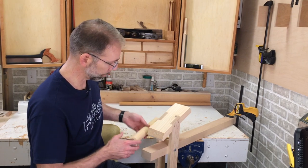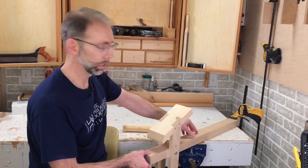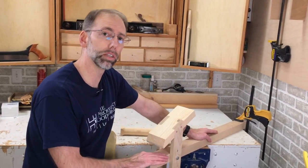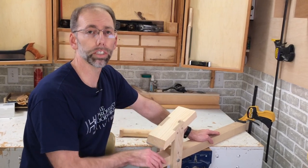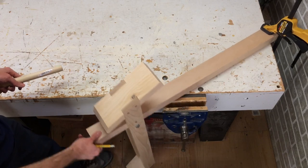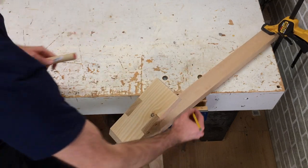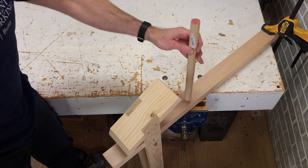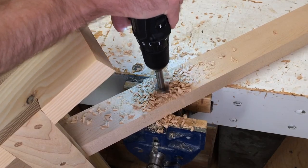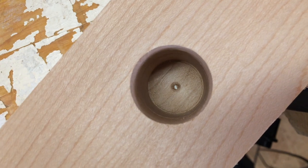I've drilled a second hole to allow me to work on thicker stock. The last thing I need to do is make sure that this doesn't wander back and forth, so I'm going to put a dowel in at the vise. I've got the full plans on this giving you all the angles and dimensions for this benchtop shave horse — the link is in the description. I'll put that dowel in and show you how it works. I'm going to install a dowel right here — I just need to mark a hole and drill it to fit. I drill until I can see light through the bottom, and then to prevent blowout I'll drill it from the other side.